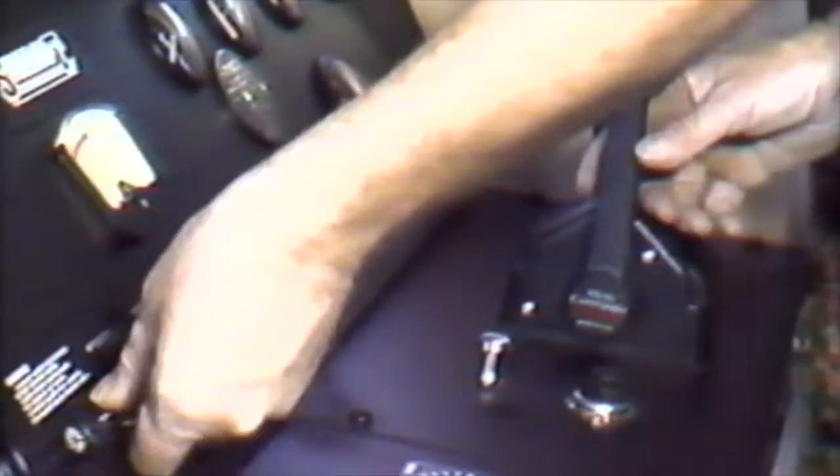These particular controls are the MMC electronic shifters. Other shifters are the hydraulic shifter and the manual cable shifter — all three are different in their operation. The starboard key activates the starboard shifter. Press the black button once to engage and continue to depress it while moving the starboard shifter. This drops the gear and gives you warm-up throttle only. As long as the red light is flashing, the craft is in the neutral throttle position. You then repeat the process with the port shifter, depressing the black button and continuing to hold it until the engine power is engaged. As long as the red lights are flashing, you are in throttle only — no gears are engaged.